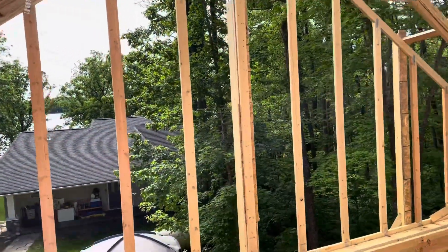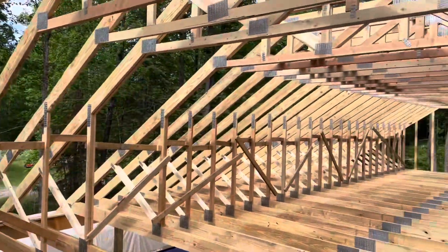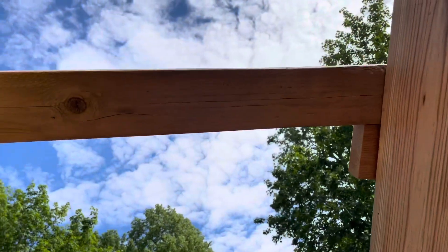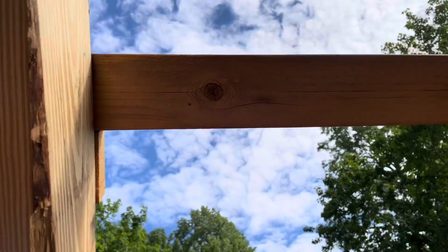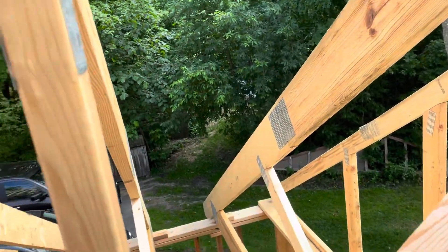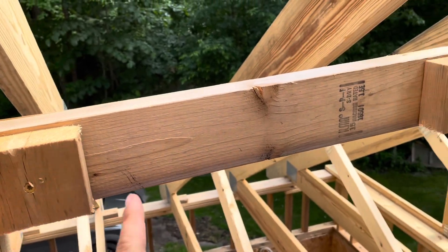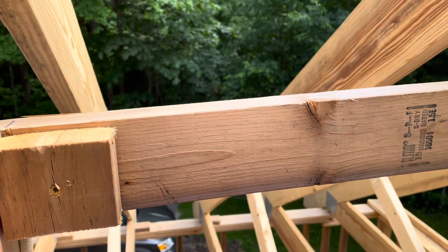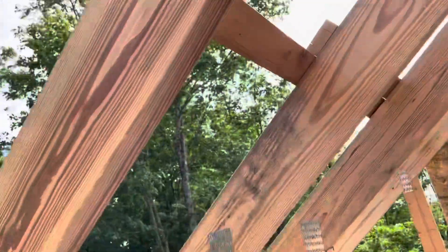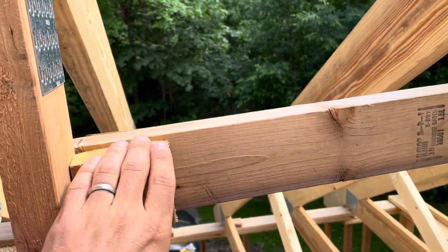Here we are upstairs in the room and attic. These trusses were 37-foot span room-and-attic trusses, which means we have a clear span end to end 17 feet wide and it goes up to 8 feet tall. As we laid these I started off putting my braces — I pre-cut them all to 25 and a half inches so they would lay up flush on each end — which worked fine except it took a long time to install. The crane operator suggested basically keeping the same 25-and-a-half-inch length but adding a small one-and-a-half-inch block of scrap at one end. That way when you're up in the scissor lift or on a ladder you can just quickly drop it in — it stays pretty well and you can screw it in. The other suggestion was to put them outside of the room in the attic so they never have to come down, whereas the ones up top will need to come down as I sheathe. That saved us a ton of time.